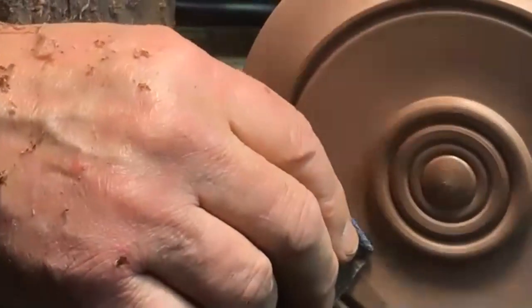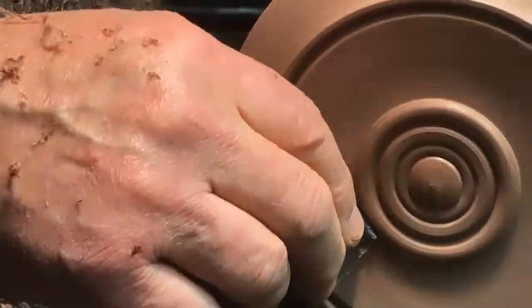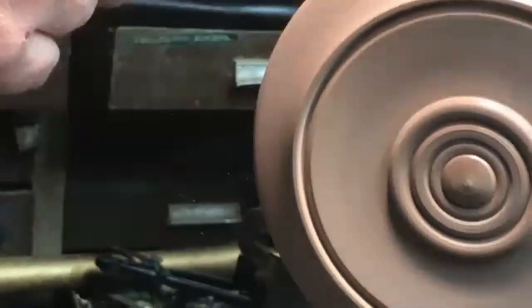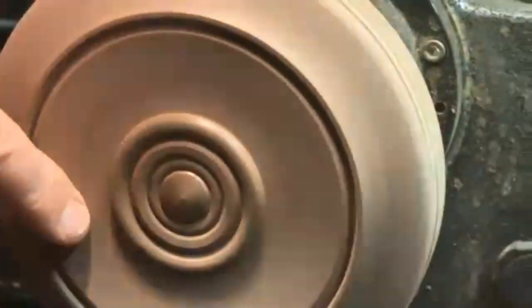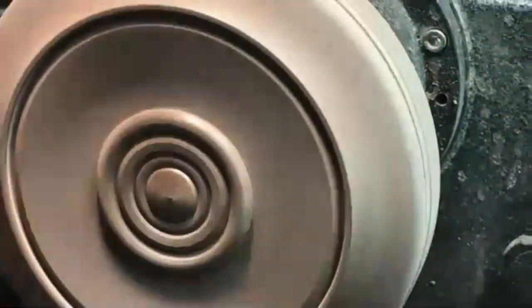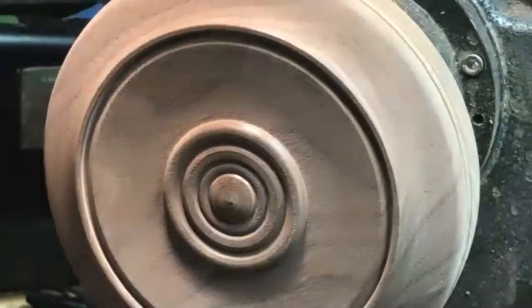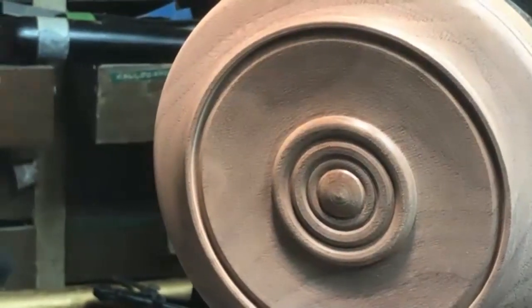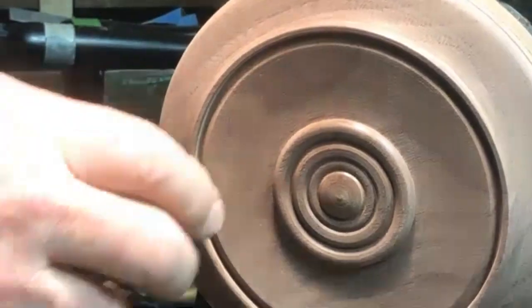Your beads - only sand up to the bead with the coarse paper. You don't want to go in there with 80-grit; wait till you get down to at least 120, sometimes 180, then you can sand the beads out. The same applies to all the bead work and parts in here.